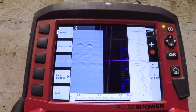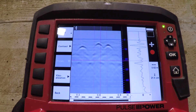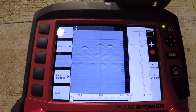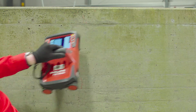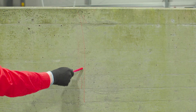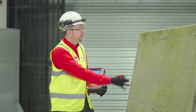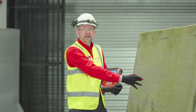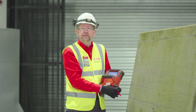When I come to a point of interest which I see on the screen, I'm able to locate that object by scanning backwards and forwards, then mark the position of that object on the centre line of the tool and locate the rebar in question. Using Hilti quick scan detection mode with the PS1000, we're able to mark the position of the bar and now we know this is a position where we shouldn't drill if we want to avoid hitting this rebar.